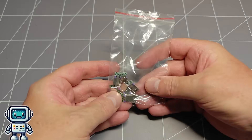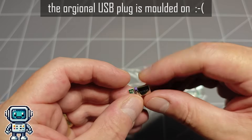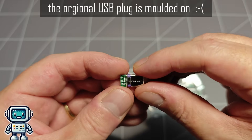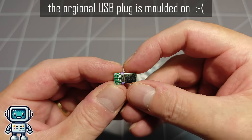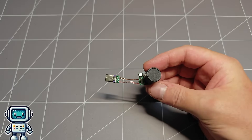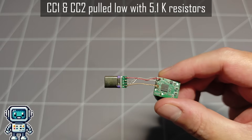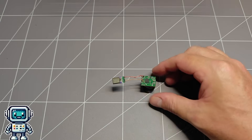Now we are going to cut the USB cable off the camera and then attach a new one. These USB type C connectors come with an attached PCB that even has pads to allow the CC pins to be pulled to the correct state to be recognized as an OTG device. In this case, we need to add 5.1 kilo ohm pull-down resistors from both of the CC lines.